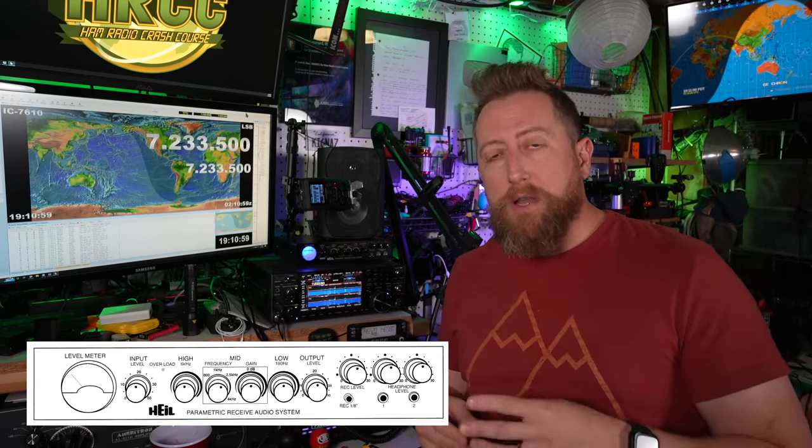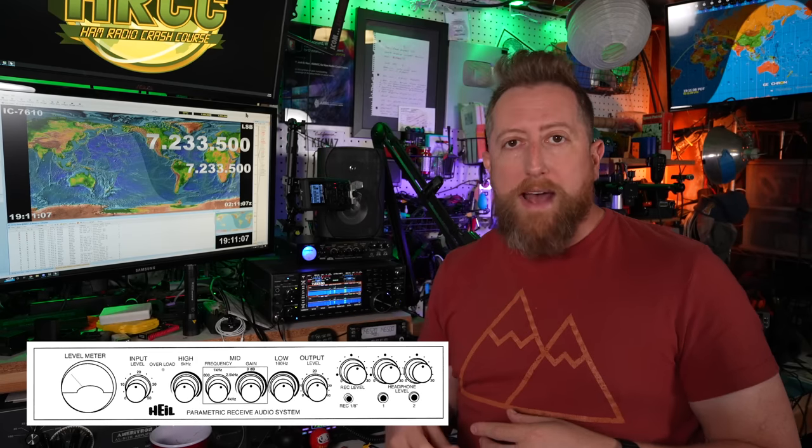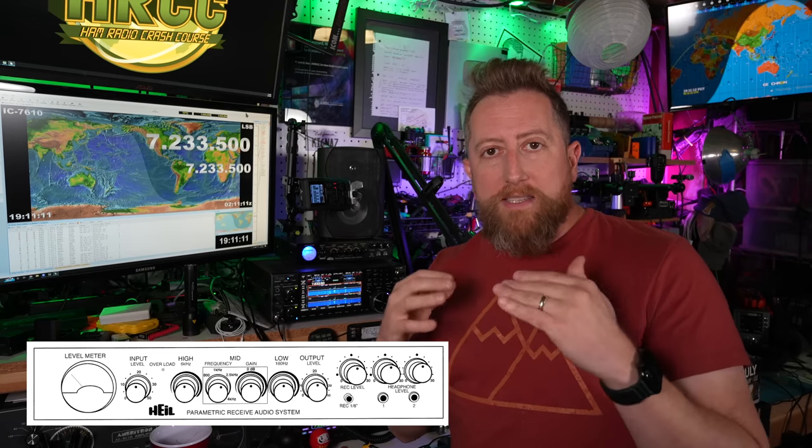As far as tuning goes, if you leave everything at the 12 o'clock position it works generally okay. But if you watch some of the clips, you'll note that in some cases I went for more of the lows or put more of a low-pass filter on to hear people with bassier voices or who were down in the noise. Giving them a little more bias toward the low side actually pulled them out some. We had a couple of more feminine voices on the radio too, so going toward the higher side accentuated those. Really, it's like playing around with sound — there's probably a prescribed way to get the most out of it, but to me, and probably to you, it's going to be very subjective in how you adjust the controls.